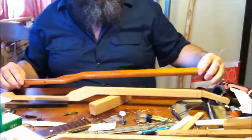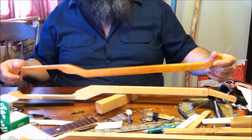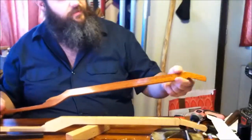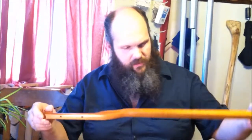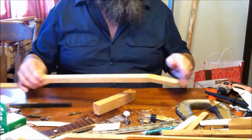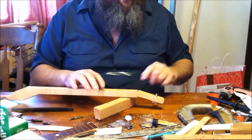We put a little finish on these — actually three coats of clear gloss polyurethane out of a spray can. I put a piece of wire up through here and hang them up from the top, then spray them top to bottom. The two that we've been working on, we did them both. They've got a nice gloss to them. What it'll do is prevent finger marks and oils from showing up. Those are looking pretty sharp.